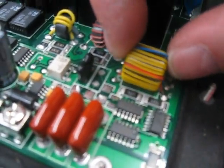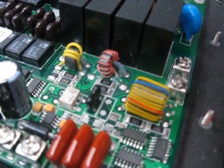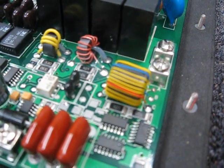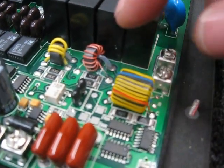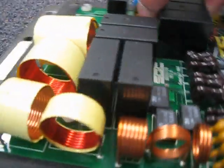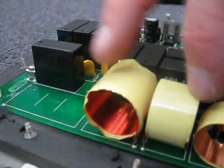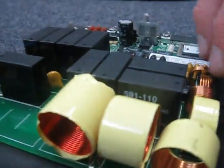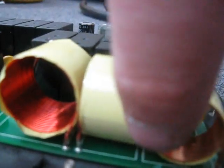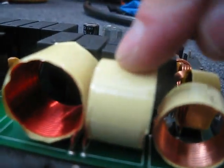This is okay if you've got it installed in a house where it's not going to move, but a lot of these smaller antenna tuners are used in a vehicle where vibration is expected. It's a bit of a shock that a lot of these components aren't bonded to the circuit board. There's no evidence of any sealant on any other coil. Normally what I'd do is put a little bead of silicone along there to physically stop them from moving.